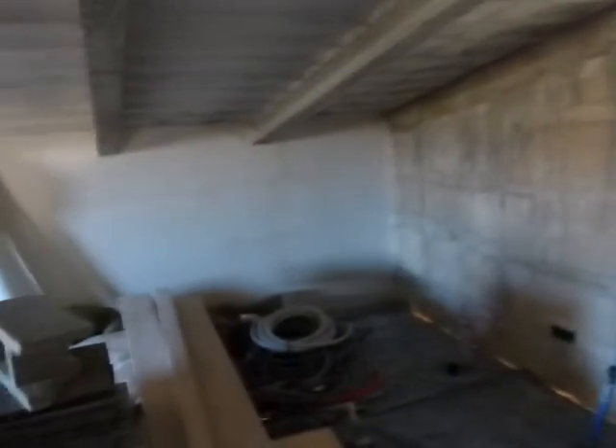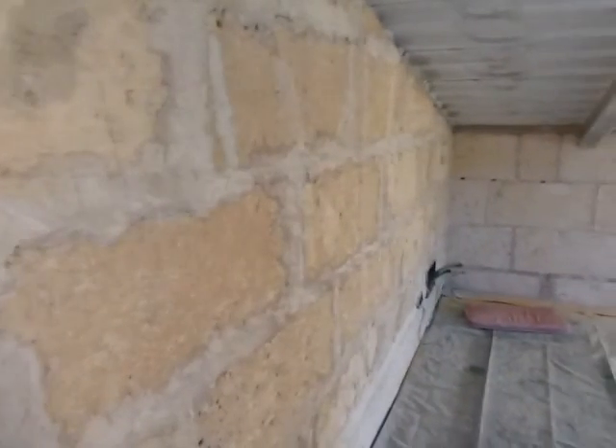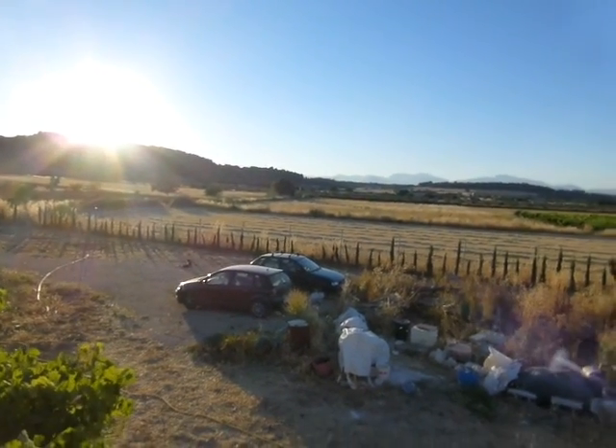We've finished this wall over here — it still seems to be drying out. On the north wall we've decided to do an insulated layer — we're going to use some cork mixed into the lime and give a two-centimeter layer. That'll give us insulation from the cold coming from the north wall, since we're not going to insulate the outside for at least another year. And here is the view from our new window — there's the sun going down over the top of the hill.